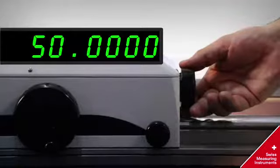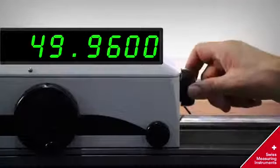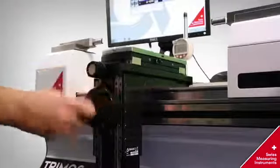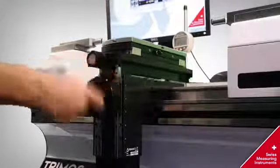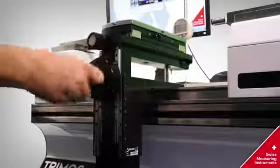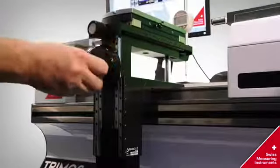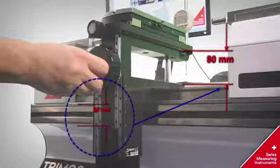The knob activates the fine adjustment. Measuring force can be simply adjusted by an Allen key from 0 to 12N and can be seen on the measuring carriage. The universal measuring table offers 5 degrees of liberty. Manual movement of the Z-axis equals the first axis of liberty. Z movement of the universal table allows a measuring range of 80 millimeters.